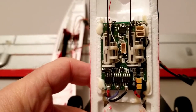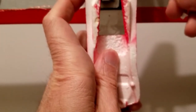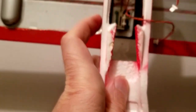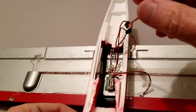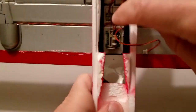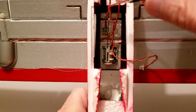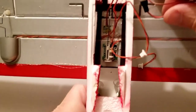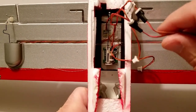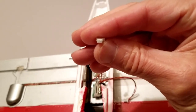While I was changing, I just tested it out. Do you see there are actually four pins in that connector? And you would expect the same, right? Female. No, there should be four female pins on the other side. So this is the lead that goes to the flap servo as well as to the light. So there's a splitter, as you can see, that one goes to this little board over here, and this board is for the lights, and then one of the wires from that split goes to that, and the second one goes to the linear servo that controls the flaps over here. These are the flaps on the inside. And then let me show you the end of this plug. You see there are only three leads.